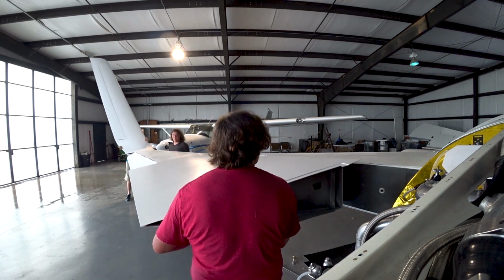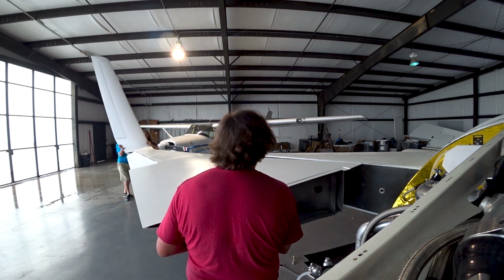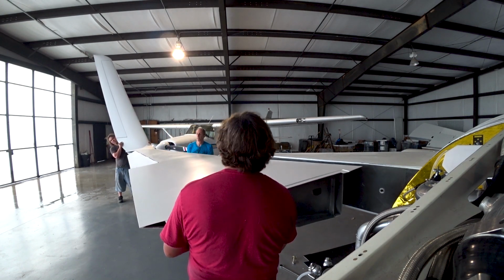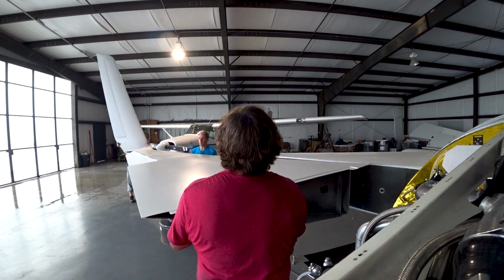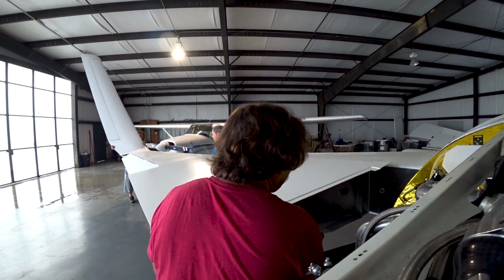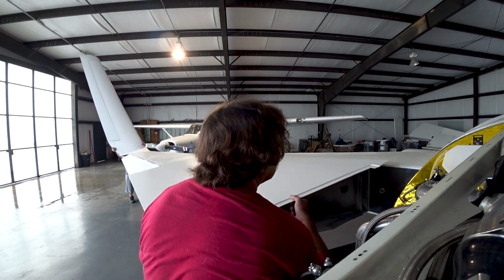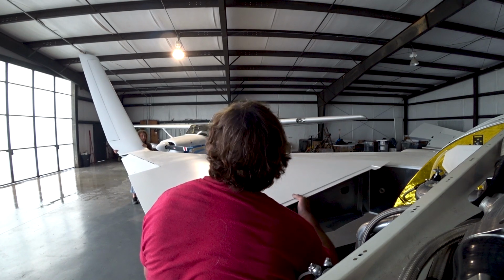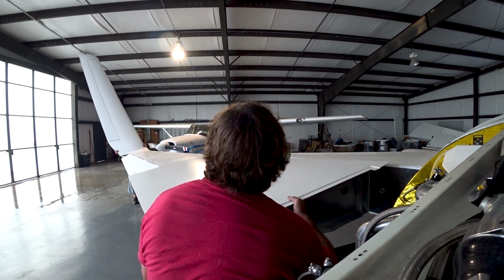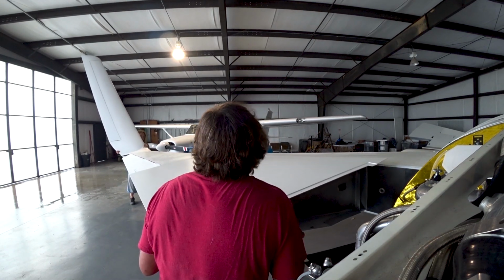Before we get it in place, you have to slide the main push rod for the aileron into place, because it sticks out of the end of the strake part of the wing. And also there's a turnbuckle connected to cables for the rudder control. Then we have a handful of connectors, mainly one for the position lights and one for the aileron trim.